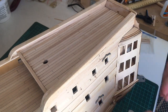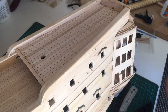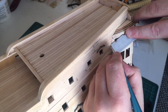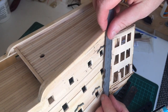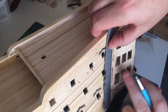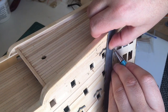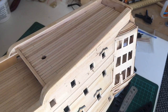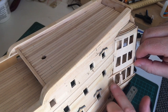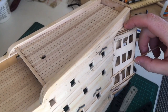This is not a molding I'm using here. I'm slightly taking away some of the window — I took a measurement of about 5mm and I'm going to transfer it. When you're adding the decorative features that come along the gallery, you don't want any of them protruding past the bottom one. It's important when you put your decorative molding on that none of them protrude right there, because it would look odd. You just need to make sure that everyone is tapered back to that line and they'll all go up in unison.